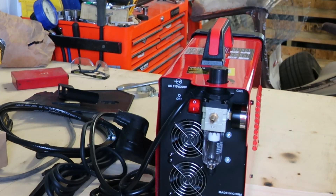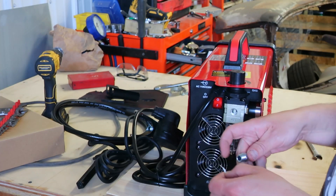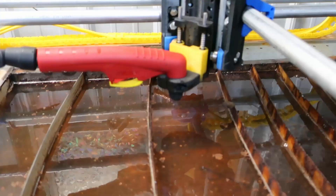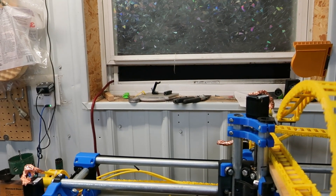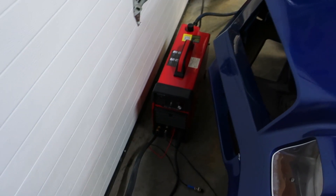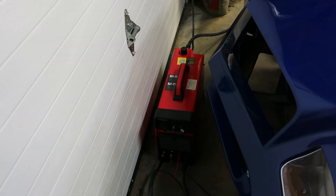The air fitting is kind of a hokey piece of crap. It resembles a normal thread though, which is a little more handy to me. So I was able to use the same torch holder - it's the same torch body. Just hooked it up there. I didn't shield this one yet, I don't know if I have to. I have a ground wire running outside with a ground stake like I did before. Still all the same cables. Got the plasma cutter set up. Right now I'm running 30 amps and 30 pounds of air pressure. I still need to fine tune it, but that's pretty good yet.